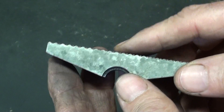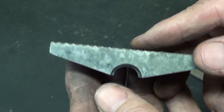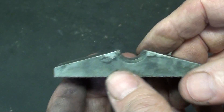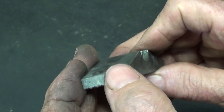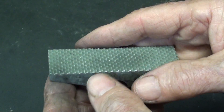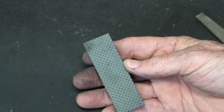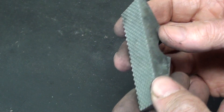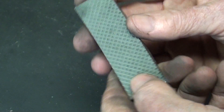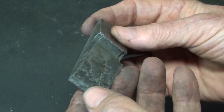I'm going to oil that real lightly. Isn't that nice? I think I failed to tell you that you cannot case harden any kind of cutting tool where you're going to sharpen it and grind it — of course, you remove the case. So it's for non-cutting tools.